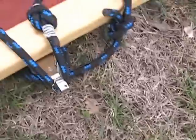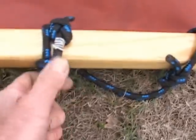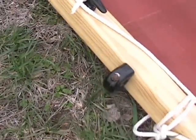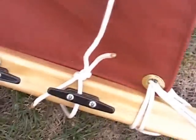Then I've got a block here. The sheet will go through and there's another one that goes down on that other end. And then I have a fair lead here to keep it from flopping around while it goes up to the front. And then I have my jiffy reefing lines going through the cleat and just going around the yard. When I go to take up in my sail, this will pull it down, gather it all up, and then I can tie those reef lines around the boom so I can shorten my sail down and hoist it back up, and then tie off to the cleats there.